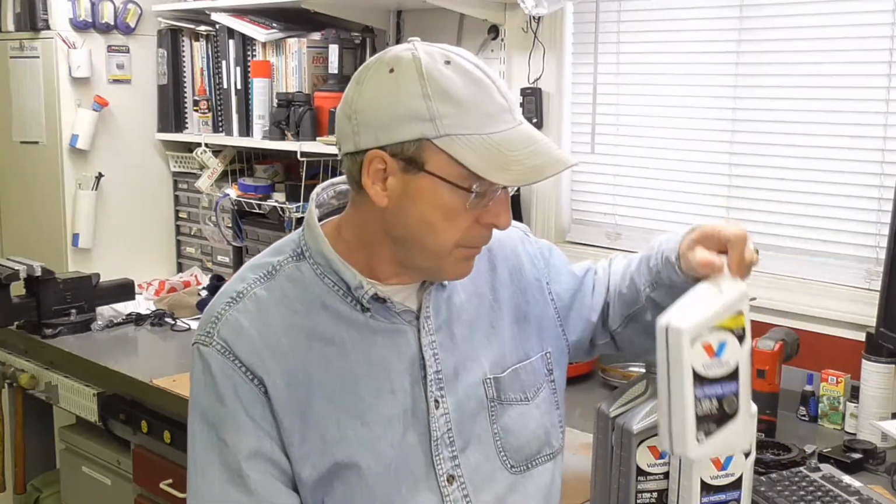Now I know there are people that profess, you see it all over on the internet, that you should always break in an engine on a conventional oil. I don't necessarily subscribe to that, but nonetheless, I am going to use the conventional oil because it's less expensive for the initial break-in, and then I'll drain it and replace it after, like I said, after a couple hours. This generator does have a replaceable filter, a canister, just like a car, as well as the previous generator. The Generac has that same setup.